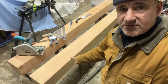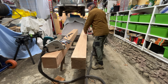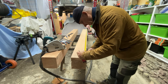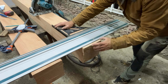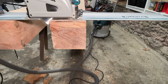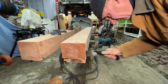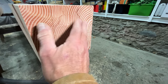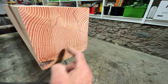Now those edges are all just taken off slightly. I've got to square up these ends first — just going to measure off 2.5 to make sure. Yeah, so it's 2.5; they've given me an extra 2 to 6cm. That's not too bad. There's a little ridge there but that's quite good. I'm going to have to watch that crack though, so I will pre-drill bigger lag bolts into there. Let's just check the squareness — this is pretty good.